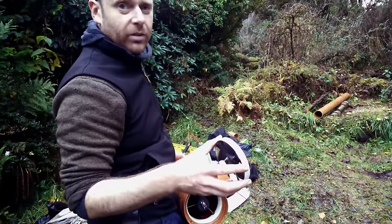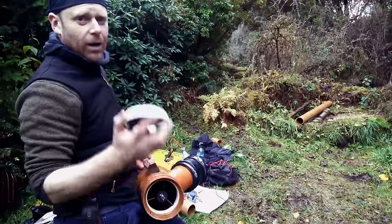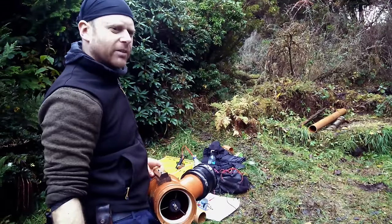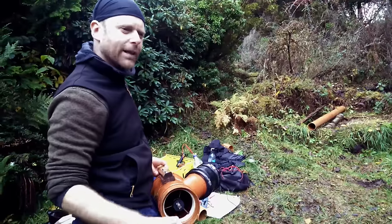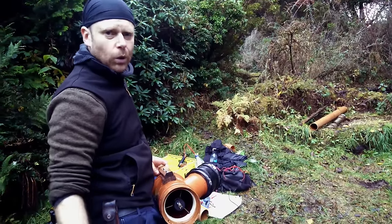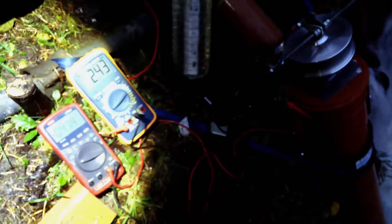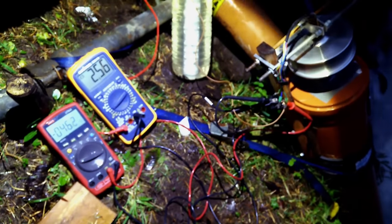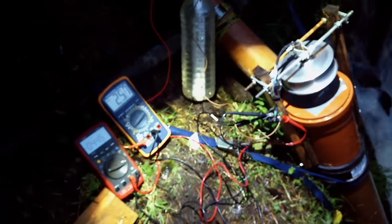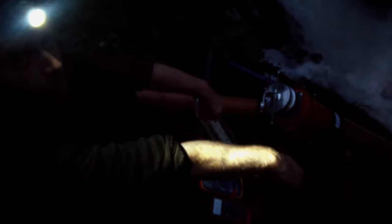I'm going to get a server fan, which is the same shape and not a lot more expensive, but a lot stronger — it's fiber reinforced. Let's chuck her in and see what happens. We're set: 50 volts, 2.5 amps — so that's 125 watts right there. That's not bad for thinner pipe. That's 50% of your open circuit voltage, and that's generally where the maximum power point sits. 120 to 125 watts — I'm not unhappy with that, and there's still room for improvement.